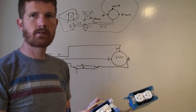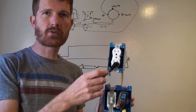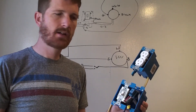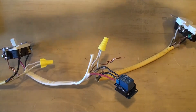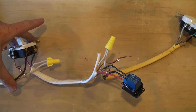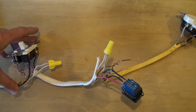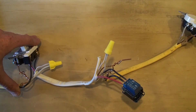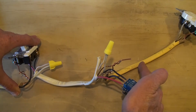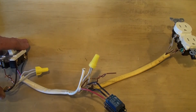We'll go ahead and wire up. I already got this one done — so this is the finished product. This switch will control this receptacle, and this relay also controls the receptacle. I decided to take the switch, the relay, and the plug out of their boxes so it's easier to see how this is wired. If this was run inside the wall, the switch would be in an electrical box in the wall. You could run this wire up into your attic or anywhere you want to mount your relay, and then this wire would go to your light or wall plug or whatever you want to control.